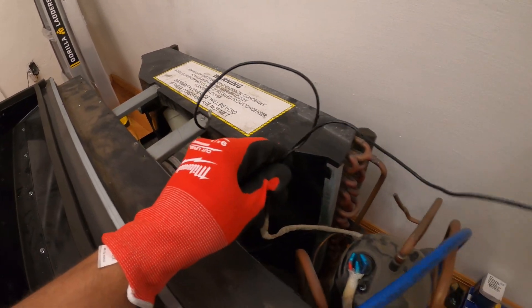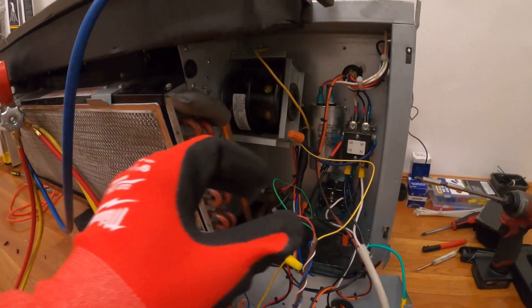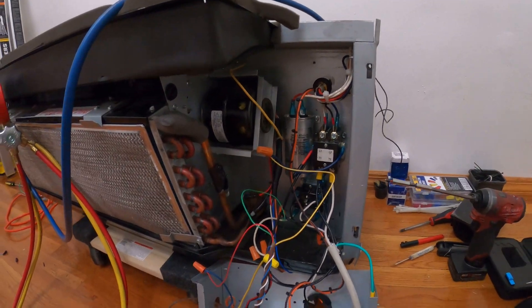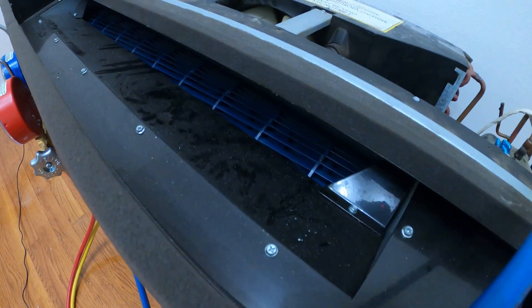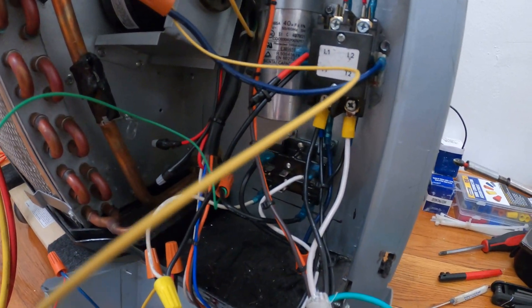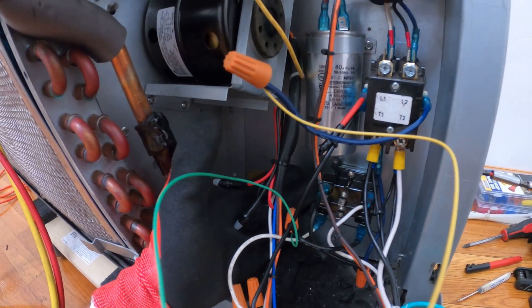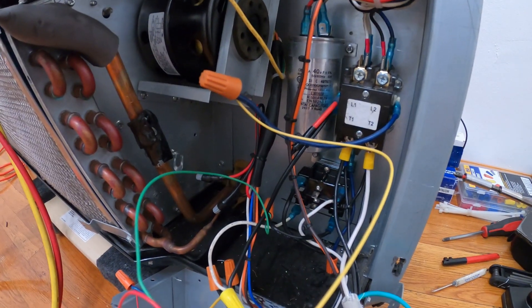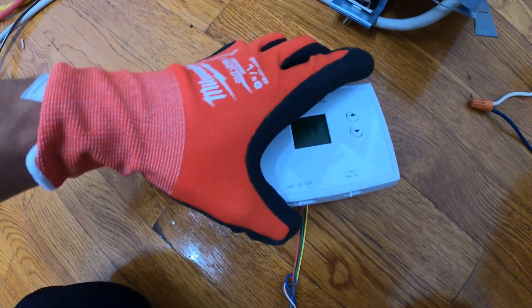This is our low pressure switch — that's the last thing I'm going to connect, but right now I'm going to see if this works. We're going to run that through our Y wire — if it trips on low pressure it's going to open Y and shut off our compressor. I'm going to switch this to on and see if our fan starts. It starts, but we do have a buzzing relay. It's quieting down — the relay I'd probably replace because nobody wants to hear that.